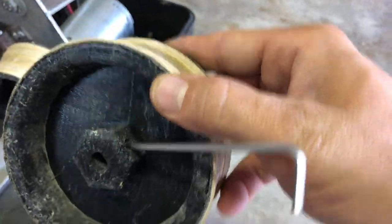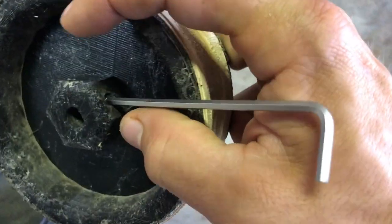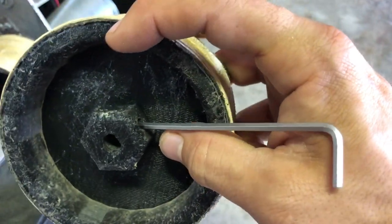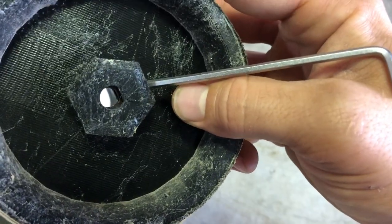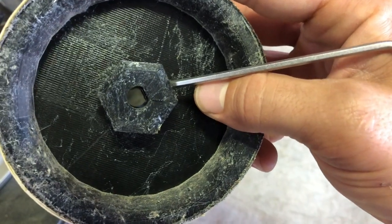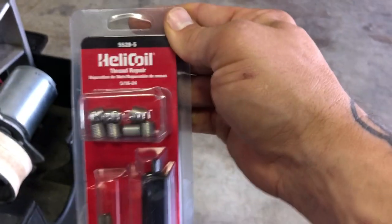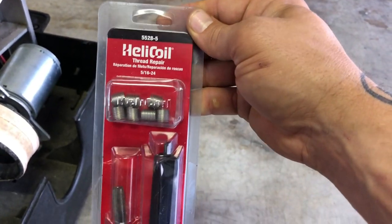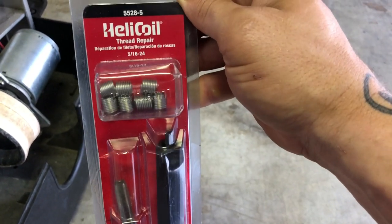On the original they didn't have a flat spot, so I drew that into my 3D design to help with setting it in place. One problem I had is that the threads on the printed wheel are plastic, so I ended up stripping them. I tightened the hub up a bit and since then haven't had an issue, but I had another idea for that.